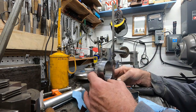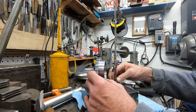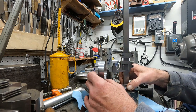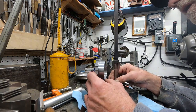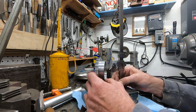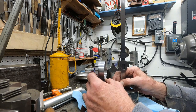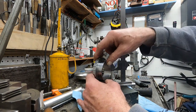I've got this old-time 10-inch vernier height gauge. I brought it to the top here, then subtracted half the diameter, and that brings it to center. Now that I've got it in a place where I can mark it, I'm going to go ahead and scribe it on the back there. Perfect — and here, and here. Let me move it a little bit to make sure I got that.